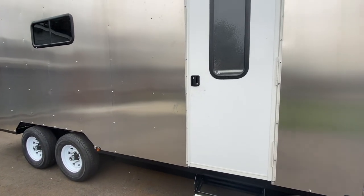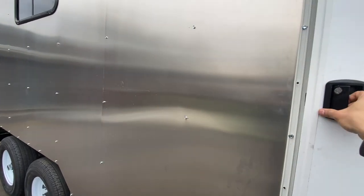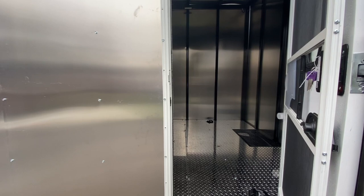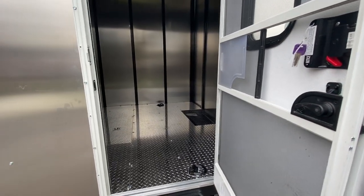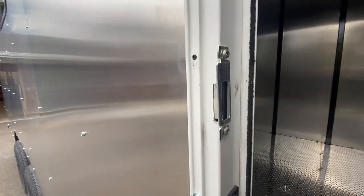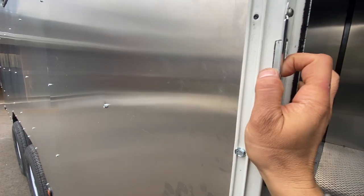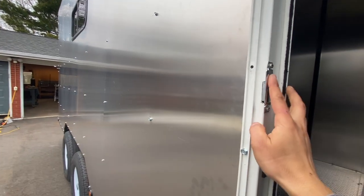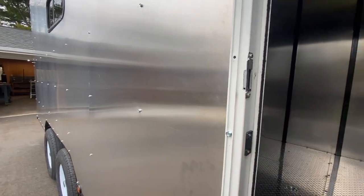For the entrance door I had a little bit of trouble. I bought this door from the wrecker — it was new when I bought it, good price — but the problem is the door is actually crooked and it wouldn't latch properly. So I had to modify the strike plate, but I'm not completely happy with it. I'm gonna remake another strike plate myself and bolt it in properly.